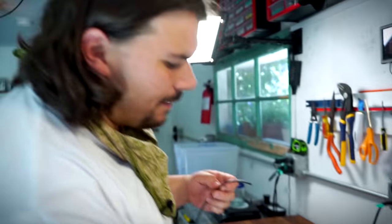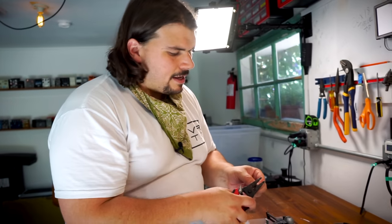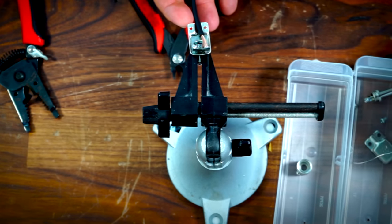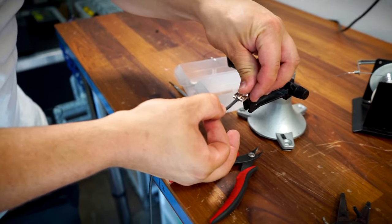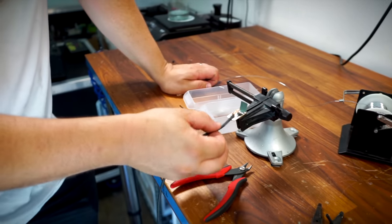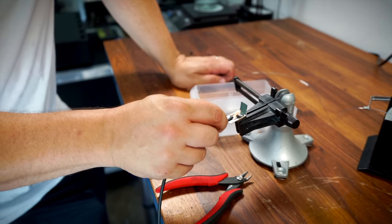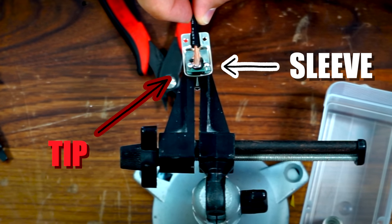Next I'm going to grab my Mogami 2314. I'm going to strip about an inch off, maybe a little bit more. If you come in nice and close, I'm basically looking to see that when the housing goes on, the outer insulator is going to get clamped in and hold this tight. The enemy of any connection like this is lateral movement — we don't want it moving side to side. If I clamp down here I'm going to have a lot more wiggle room than if I clamp over the outer insulation. So I want to make sure that if I'm clamped there, I still have enough room to reach the tip and the sleeve.